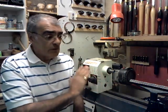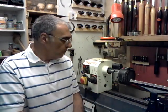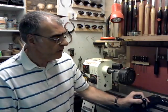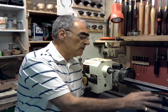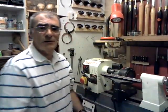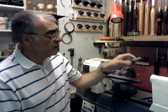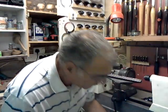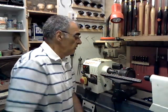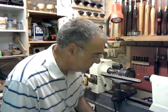Having said that, it has done me proud and it will do me for quite a long time yet. What comes when you buy it: the basic items are the tool rest banjo, a 300mm tool rest, and obviously your tailstock. The accessories that come with it as a basic starter are the revolving centre for the tailstock and the two Morse-taper centre for the headstock, so you can do your centre turning out of the box.